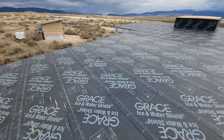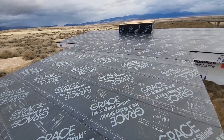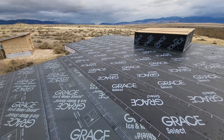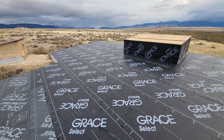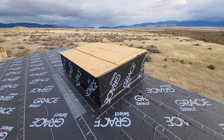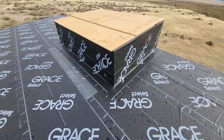I'm standing up on the roof now. You can see I got the whole roof sheeted and covered with ice and water shield. This will keep it dry for the winter. This will be the vent box, skylight box — it's just kind of temporarily sheeted over for the winter. It's all flashed correctly.